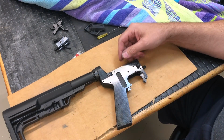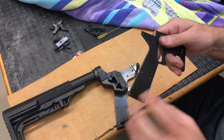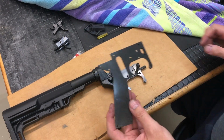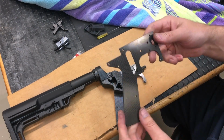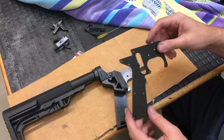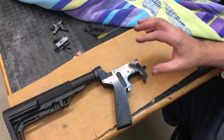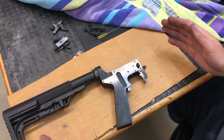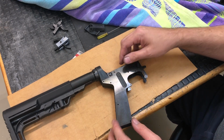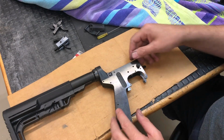This is a 1K, an aerospace grade carbon fiber. This isn't your cheap Chinese carbon fiber. I had this specially made for some other projects I was working on a few years ago, and I have a couple sheets left over. This is 1K, extremely tight grain, and I think this was about $170 to $180 a sheet, and a sheet is 18 by 24. So it's not the cheapest, but I think it's going to be really cool for this because it's going to lighten it up and give me a little bit more rigidity.